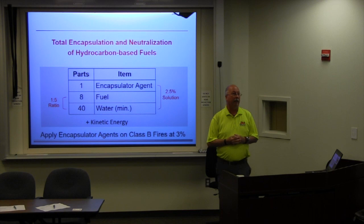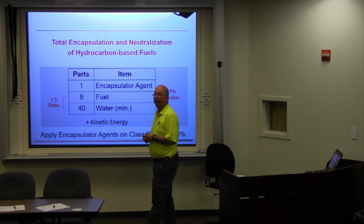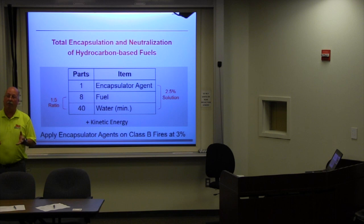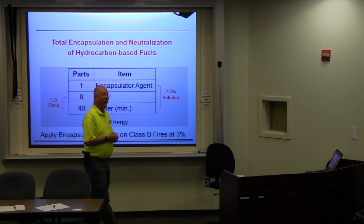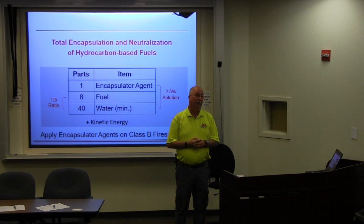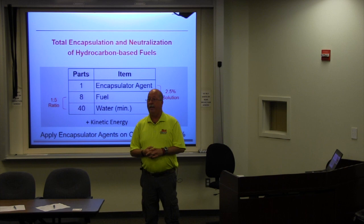Okay? So let's think about this for a minute and consider that 9,000 gallon gasoline tanker going down the highway, flips over, catches fire. You arrive on scene, you start looking at it, and the foam's not going to work on it. Well, hey, about 40 gallons of encapsulator concentrate, you're going to have that fire out. In fact, I'd be willing to bet you, after you get used to it and do a little bit of training with it, get really good at it, you can probably put it out with a lot less. And you'll probably have the fire out in less than 2 minutes. However, within that 2 minutes, you haven't applied enough F-500 to encapsulate 9,000 gallons of gasoline.